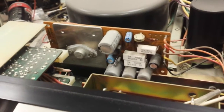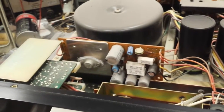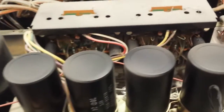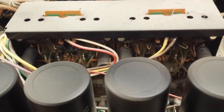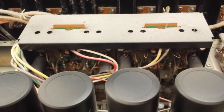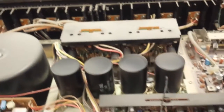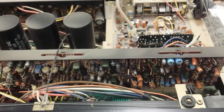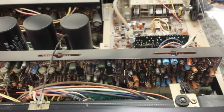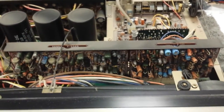It's also pertinent to re-heatsink that TO66-style transistor to the heatsink there. The heatsink is adequate, it does not need to be increased, and I would just leave that alone otherwise. Back here are the driver boards — these are the same 26-24 boards which are used in the 9090dB. Some of them have slight modifications, although my memory doesn't serve me well enough to know what those are. In front of that are your two decoder boards, the F2087 and F2088. The 2088, I believe, is the logic board, and the 2087 is the matrix board.